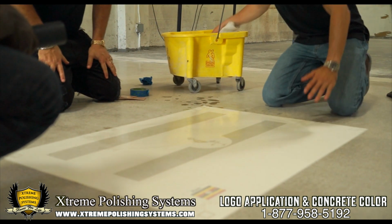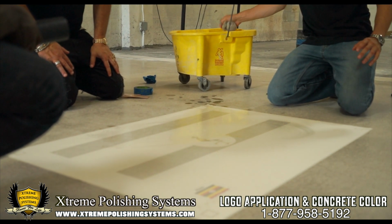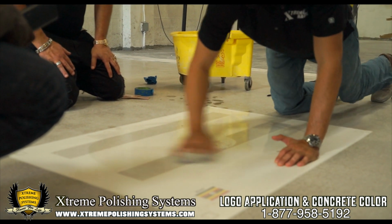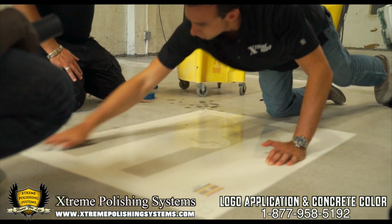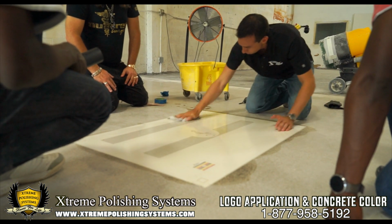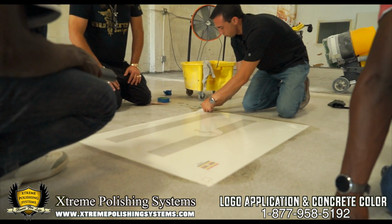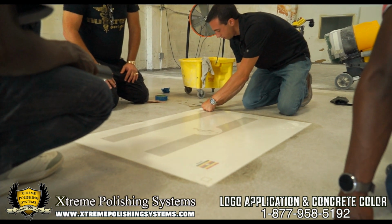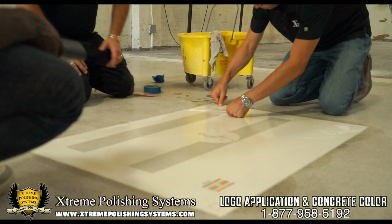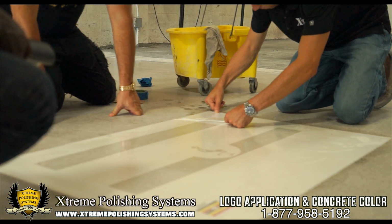That's the actual film that's on top of the concrete right now. We're going to be removing that, and basically the water just helps you remove this piece a lot easier. Yeah, it peels apart a lot easier. Just getting everything wet. Keep your registration marks in place, especially when you're doing multiple colors. It's important you have that in place, which is this piece right up here. That's the registration point.